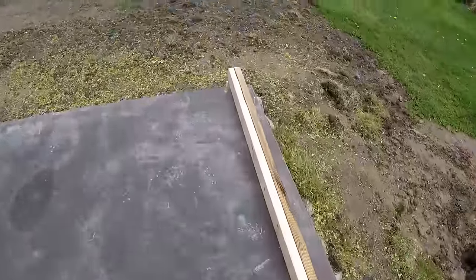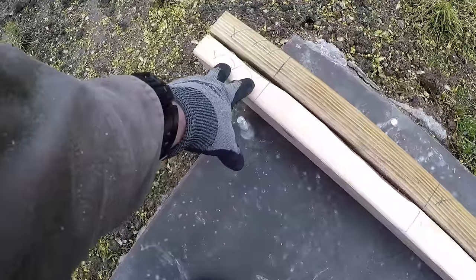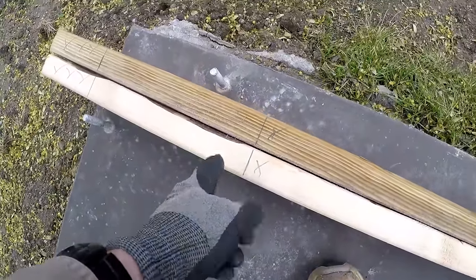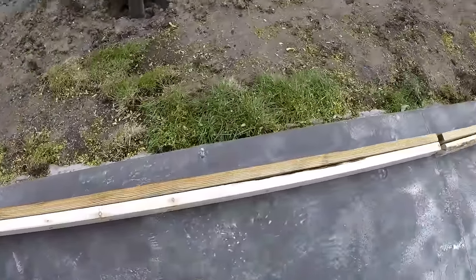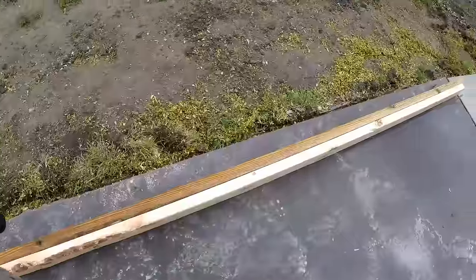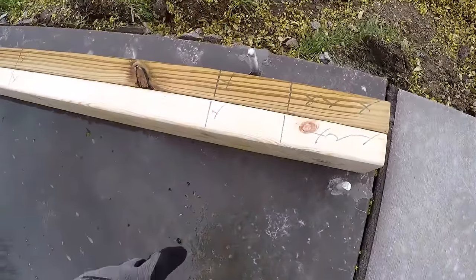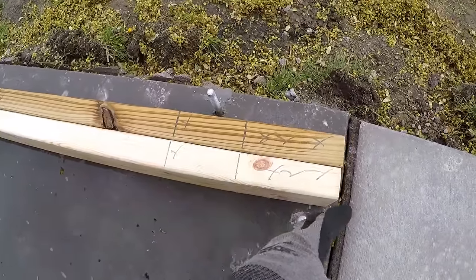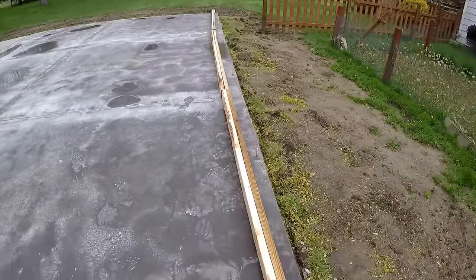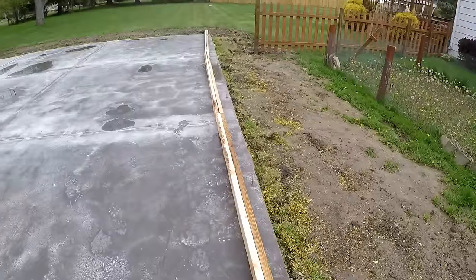All right, here's my first plates cut and laid out. 5 inches here because this will have a corner. Then 15 and a quarter in from the outside. We go 16 from there. 10-foot plates because it's a 30-foot wall. I'm not a fan of that. Should have been 16 and 14, but I have those for top plates. And we're 30 feet, so we don't land on 16, but it is what it is. So that's done. I'm gonna get the other side laid out, then we'll flip these down, mark for the bolts, drill them.